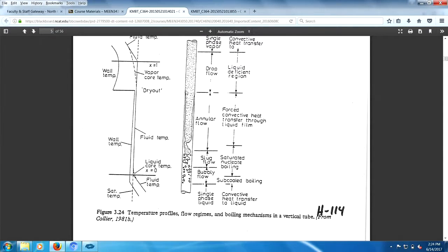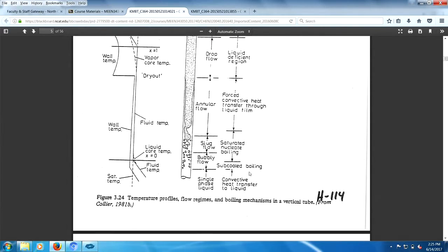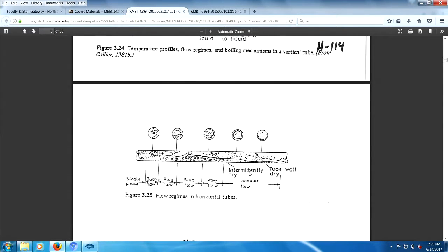Now, that's a point of tube failure as well. So you come in with your fiber optic camera tube and look around. You look around, nothing. And the tube crack would be right there. So this is the region you have for inspection. For a boiling tube heat exchanger, you want it to be very focused on that one point. Of course, there's a lot of things you want to look at, but that one in particular is. You believe that? There's a lot of strange stuff.